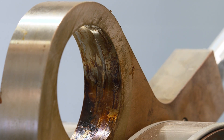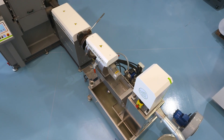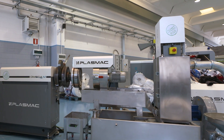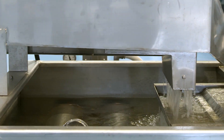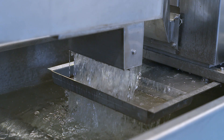If required, a hydraulic or even a fully automatic back-flushing screen changer can be installed. The pelletizing system is Plasmac's ultra-compact hydro-cooled pelletizing system. The stainless steel cutting chamber is mounted on a linear rail for simple opening and closing. Two pumps are used: one to fill the collector or cutting chamber, and the other circulates the water from the tank through a heat exchanger and back into the tank to maintain a constant water temperature. It is a closed-loop system, with the only water used being through evaporation, which is negligible.